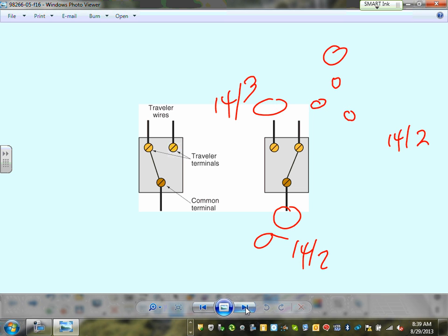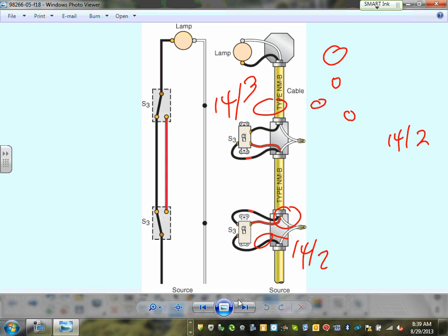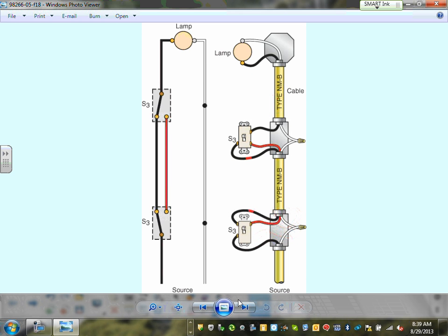So that's your wiring methods. We talked about, guys, three-way switches, and we wired that one a second ago for you. Snap switches. Here's an actual wiring for three-way switches if you have never wired a three-way switch. Like I said, guys, if you want to understand the three-way switches, you have to understand that the travelers have to be tied to the travelers. Any comments, guys, about tying the travelers to the travelers over the three-way switch? Travelers, these two terminals. To do this, if I bring this one on a test, would you guys be able to wire it? Draw that.